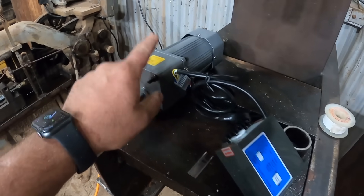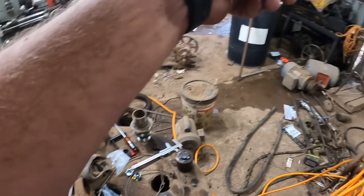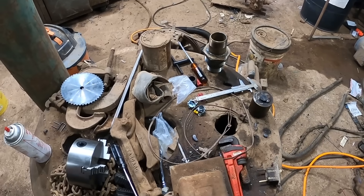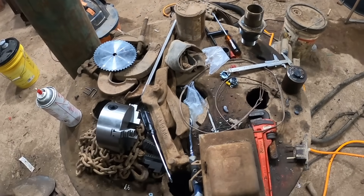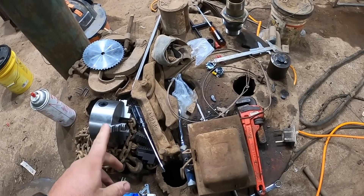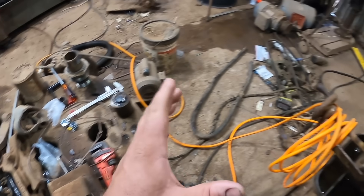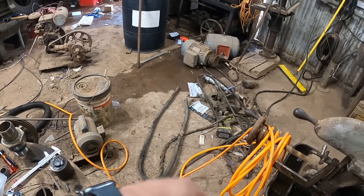What I'm wanting to put together: I've got a little low-speed high-torque motor with a little Chinese controller, a chuck, and I'm going to make it chain drive. There's a couple of pillow block bearings over there. I'm wanting to build something that's just about one foot cubed that sort of houses all this. You can just pick it up and carry it — not super heavy — and just set it on your welding table. If you want to weld on something that's pretty long, you can build a yoke or maybe use a car jack stand at the other end.